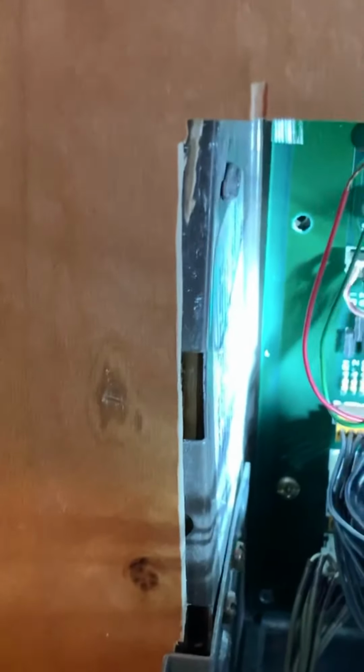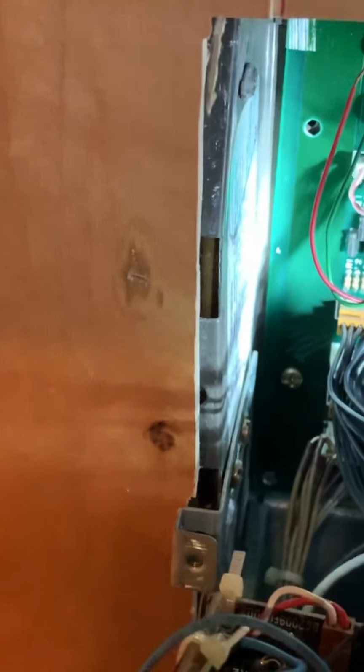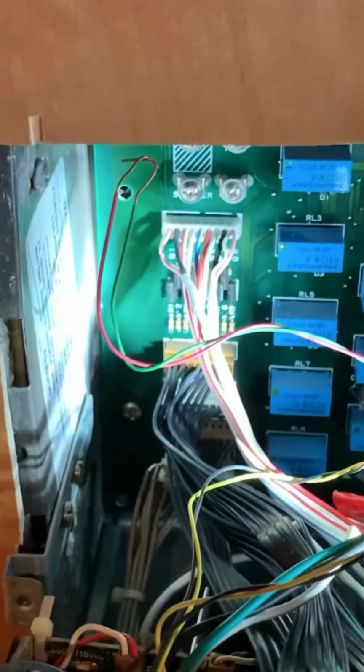Boom, those 2 black wires, I'll just tie them off with a cap, and then I'll put the rear door speaker wires back on. And then where the speaker wires were on the front door, that'll be my power source now. And I hope that makes sense. And we'll show you how I'm putting the relay together once I get that installed.